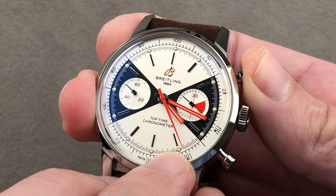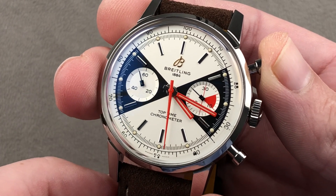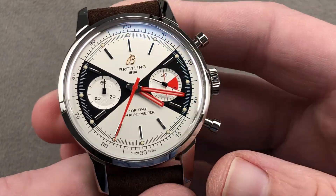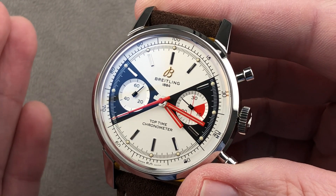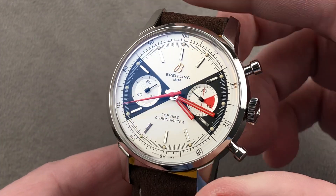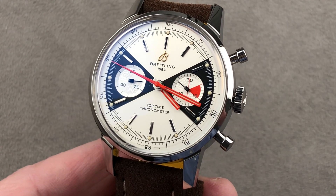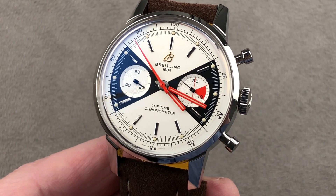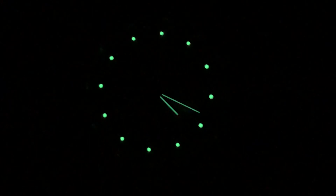It's a lateral clutch engagement, so while there is a little jump and stagger in the seconds hand at start, it is a very shock-tolerant design. It is a COSC-certified Swiss chronometer adjusted in five positions — a third-party certification confirming the watch has undergone multi-position, multi-temperature testing for two weeks, varying no more than six seconds gained or four seconds lost in any 24-hour period. This is the 2,000-piece stainless steel 2020 Breitling Top Time Mask of Zorro limited edition, and we're back with it by night.